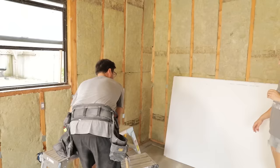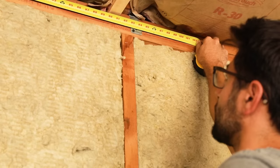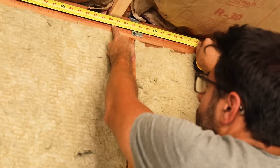All right, so let's get started on this first piece. Your beautiful assistant is here to help you. I'd like to introduce you to my beautiful assistant, Sarah. So we're going to use 5/8 drywall on the ceiling. We're going to screw it in. So your drywall sheet is 8 feet long, but we want to break on the stud. So our measurement is going to be 90.5.